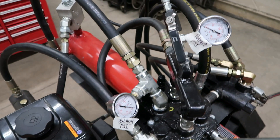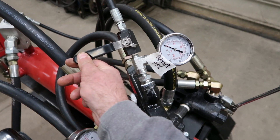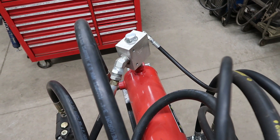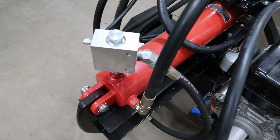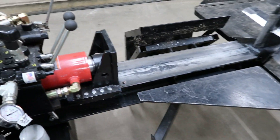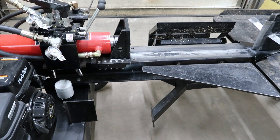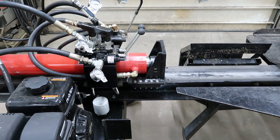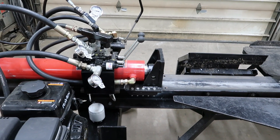What I did here by replumbing this, I added in this ball valve on the pilot circuit that controls the dump valve. My main goal is to see how much, if any, benefit this dump valve is adding to this splitter. I'm going to set the camera up back here, fire this thing up, and let you folks listen and time what is going on when I have the dump valve in operation and when I have it off.